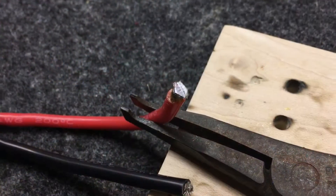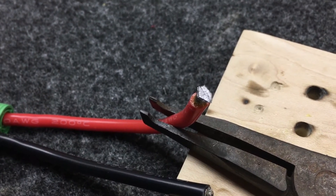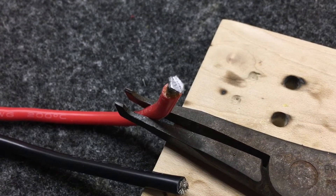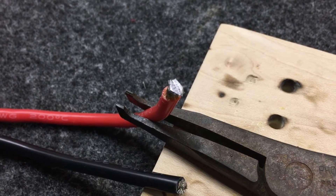The one that I really hate to see, and people just don't understand how important it is, is wires not tinned correctly. Just because there's solder on the outside of that wire does not make it a tinned wire. We're going to show you in the video how to do that correctly. This is a 10 gauge wire that we just soldered up, then took side cutters and cut it — and if you look, there is solder from one side to the other, all the way through. That is very, very important for a good connection.